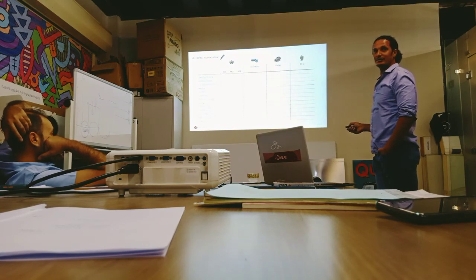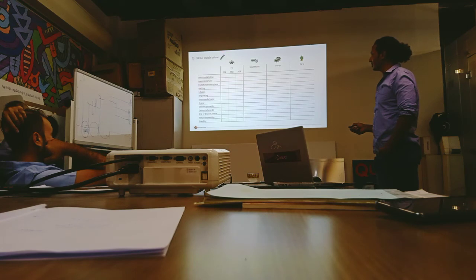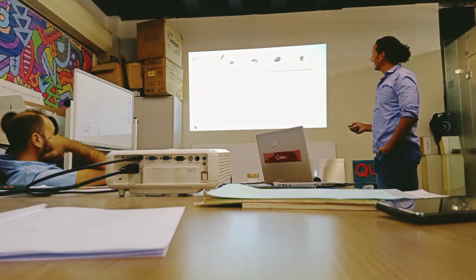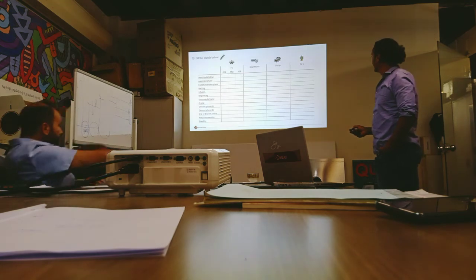Are you sure? Yes. It will go to FC2? I think so. So FC2, remember, is FC2 here. Rear motor? Yes, it's working in the backing. The pump? No. Infusion? FC2. Gear motor? Stop. Infusion, stop. Pump motor? Not working, because pre infusion. Think about it. Group valve? Open. Group valve is open.